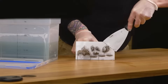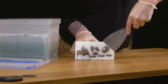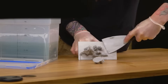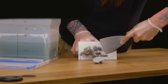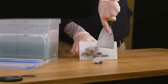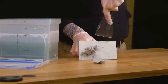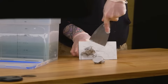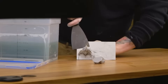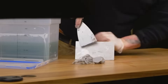I'm not going to discuss the resin parameters too much because it all depends on what printer you're using. I found the settings for this resin on my Phrozen 8K Mini on Lychee, and they weren't far off right apart from the base exposure. That was 20 seconds, and look at how hard I'm having to work to get it off — I bet I could lower it to nearly 10 seconds. It does mean the resin cures rather rapidly, which is good.